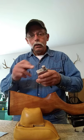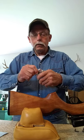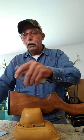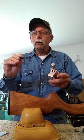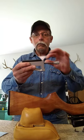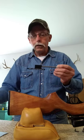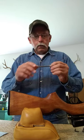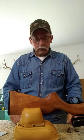First thing we're going to do is remove that front screw which holds on the retainer plate. With the included 1/8 inch Allen wrench, we'll take that screw out first. Set that aside, slide the retaining plate off. Now everything is lubricated, there's some light grease on it, so you might want to set that on a rag or something. With that retainer plate off, you can slide the mount and the adjusting rod and the knob off the rider. Set that aside, and now we'll just go ahead and thread that rod out of the mount.